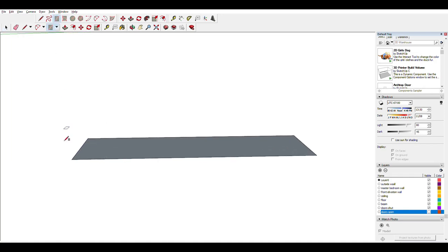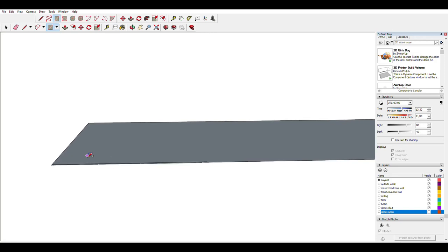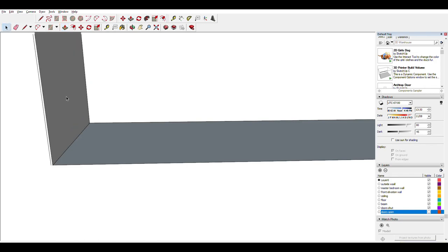I know that my first job is to have an end panel. In this case, I'm going to make the end panel 6 mil, actually, because it's just going to be a glue-on piece, if you like. So we're going to do 6 by 600. That's gone the wrong way, so you'll get the orientation right. So it's actually 600 by 6. And then I know that the height of these wardrobes, without going back to the drawing, is 2174, not 5. Make that a group.